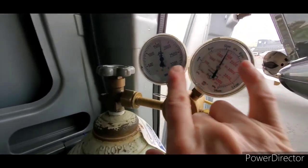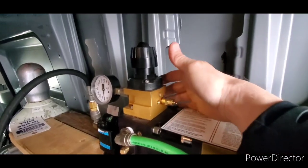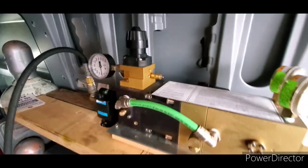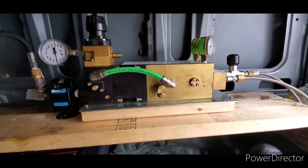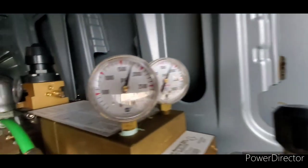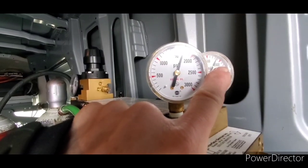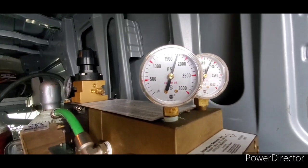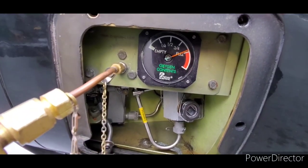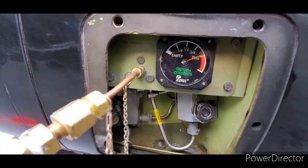Now we need the booster. I have turned this regulator in all the way and I am maxed out, but the gauge is not yet full. Over on this side there's just a little toggle switch — forward is off, that's on. Now the piston is going, and you can see this reacting. We need a little bit higher than actual 1,800, so that 1,850 is going to get us right up to what we need pretty shortly. Our oxygen gauge is almost full — I'm just going to go a little bit further and we'll get what we need.